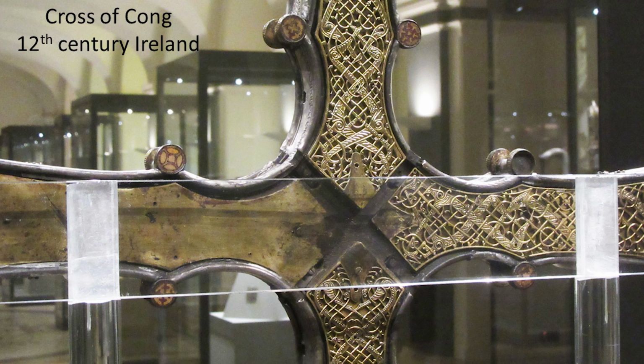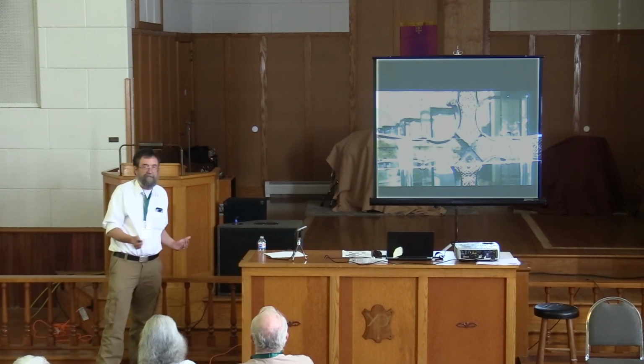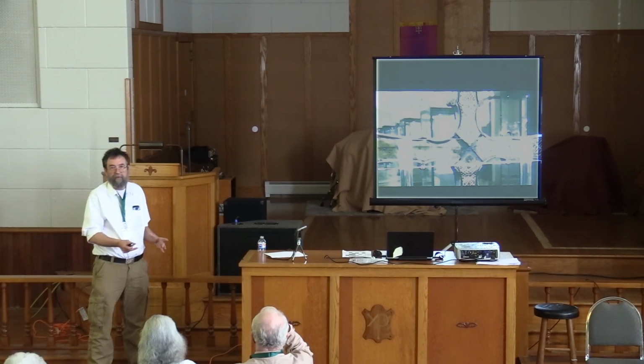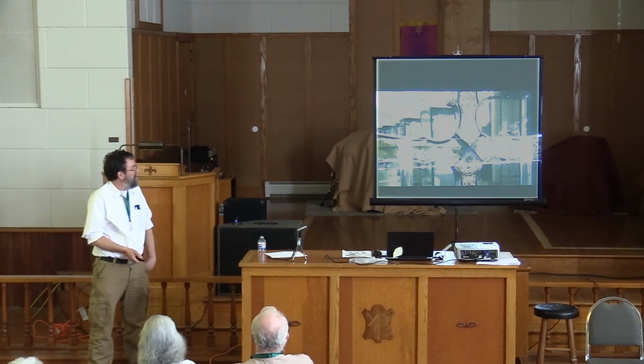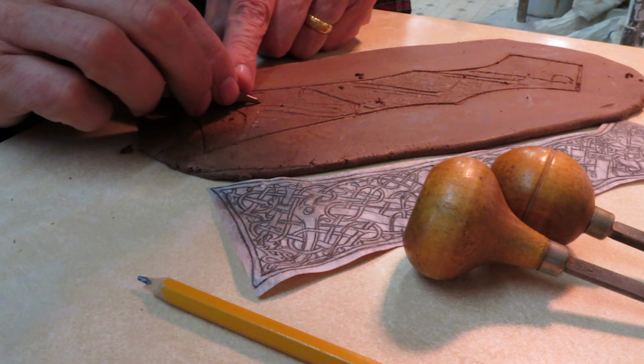In looking at this piece, I think it was carved in the negative. You could pierce something out like that, you could make it in wax, there are other ways to do it, but I look at this now and I say carving that in the negative would be the most efficient way to do it. But to cast it, you'd have to have your mold very hot, because these very thin channels are going to cool too quickly. If you pour your metal in at the same temperature I did the brooches or the stem, it's going to freeze before it fills all those little thin capillaries. So it seemed much more likely that this was done in clay, because you can carve clay, you just can't carve it the way you do chip carving. But if you leave a little island, and there's space between the paths of these little beasts.